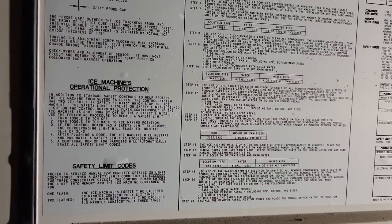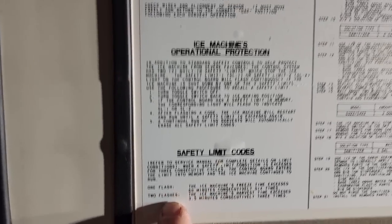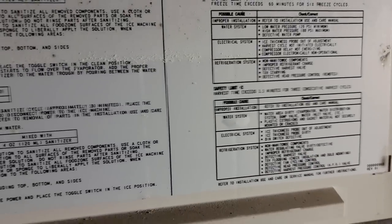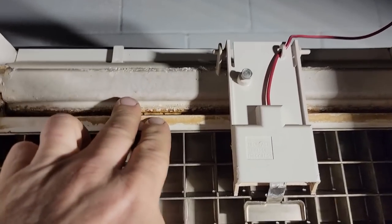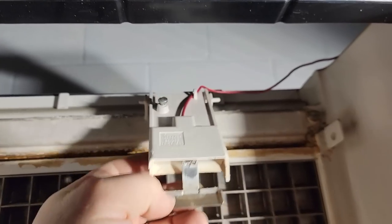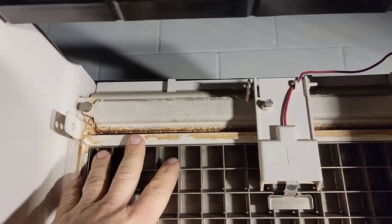Usually we'll put it over here on the panel, so let's see if we can find that safety limit. Normally one flash or two flashes, but we don't have that. It's kind of a weird one — neither of the normal ones. We can tell that we've got a lot of crud up in here. That's going to cause false alarms. It's got too much calcium in there.